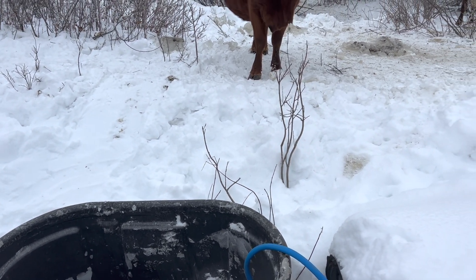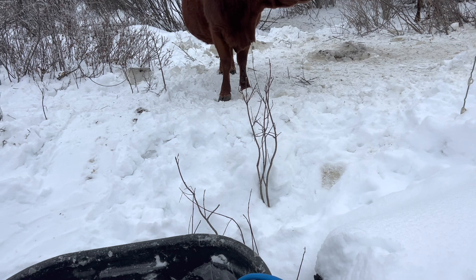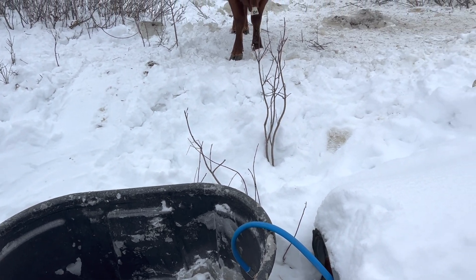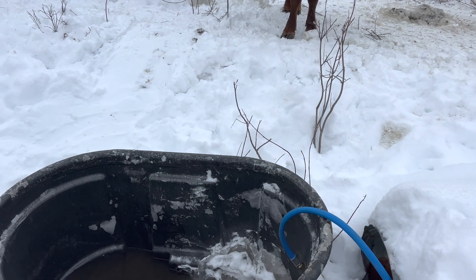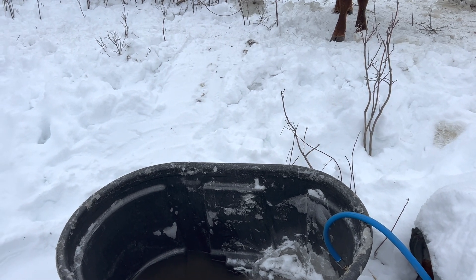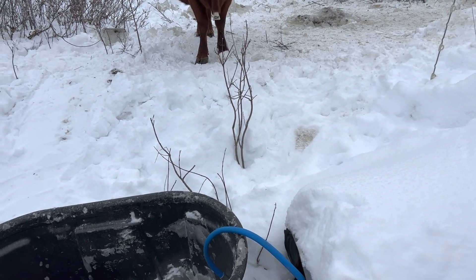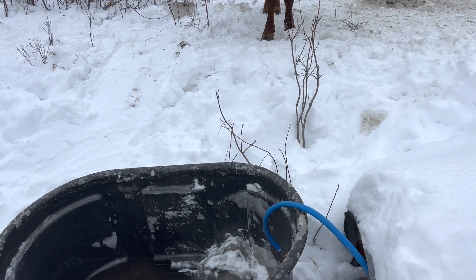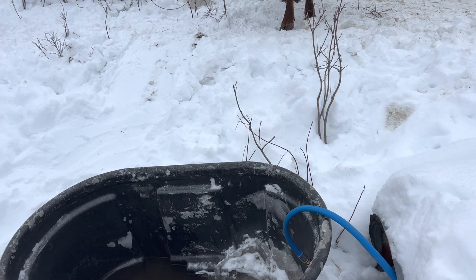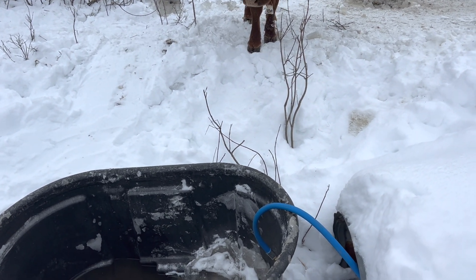Since it's going to be continuous flow, it'll keep the ice off while it's cold. I'd call that a grand success. Hopefully that's a dirty-water rated sump pump, otherwise it's going to get clogged up. It's cheap anyway, and there must be a way you can take them apart and clean them. It's just the motor getting burnt up inside. But for an experiment, this has been successful. That was so easy — even if you had to roll up the hose and the pump and take it up to the house, you could leave everything else. It's so cold that the water's freezing, then it's overflowing on top again.